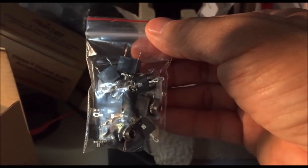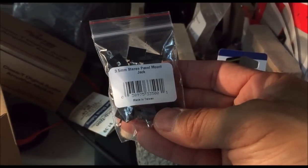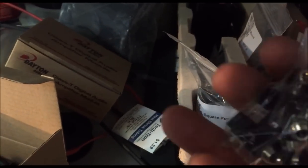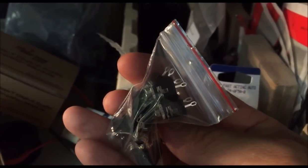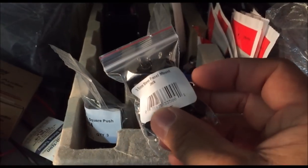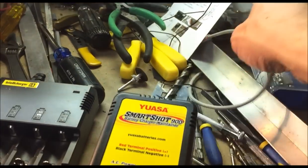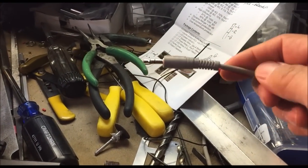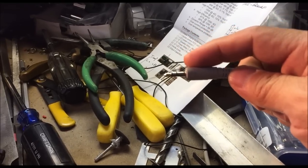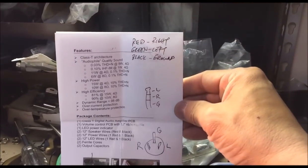Here's a baggie of 3.5mm jacks I picked up from Radio Shack — again, pennies on the dollar. All you have to do is drill a hole and they have a little lock washer to secure them to any thin flat surface. You can look up a pin-out for a 3.5mm jack to find out which conductor is left, right, and ground. I believe the conductor to the right is ground, the middle is right channel, and the end tip is left. It certainly helps to write those down.